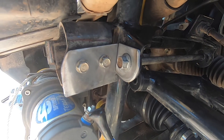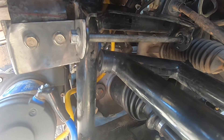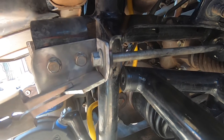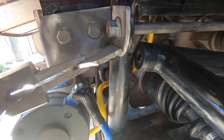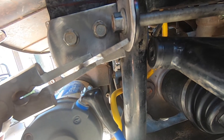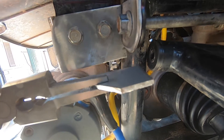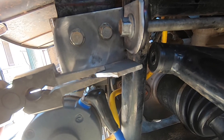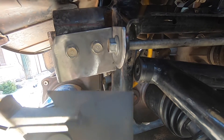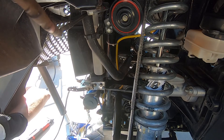So here's what I've got — both those pieces just like that. Hindsight's 20-20, I should not have rounded the bottom of this one. But what I'm going to end up doing is taking a gusset and getting it in here. I'm actually going to put it on an angle so the water drips off of it. If you notice on the bottom there's a little bit of a lip on the A-arm tab so I can weld to the back side. The key is when you tack this in you want to be able to get to your bolts. I don't want to weld too much on the vehicle — I put my ground right there on the metal.